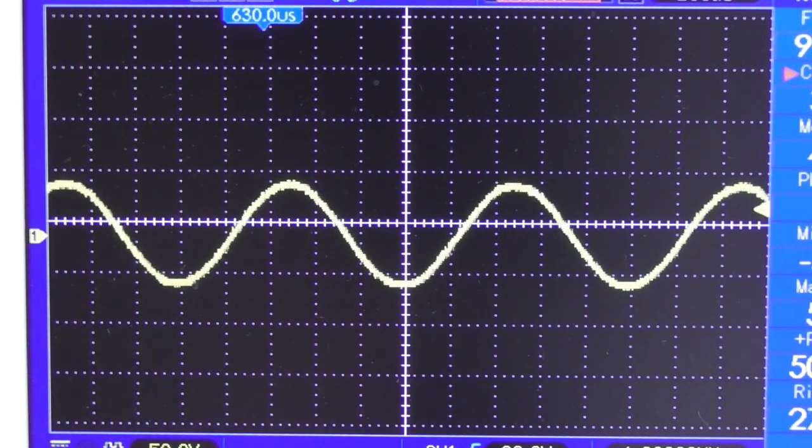If you have an amplifier with a nominal line input, 100 millivolts, let's say, won't drive the amplifier to full power. But with this preamp on there, if you inject 100 millivolts, you will get 600 millivolts out. So ideally, if you were going to use this with say the power amplifier that I've been building, you would need about 200 millivolts in to get about 800 millivolts out, if my maths are correct.